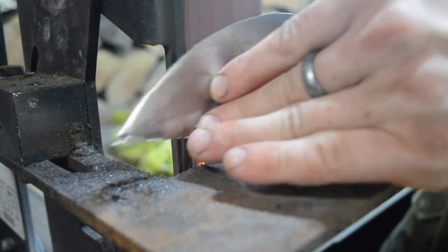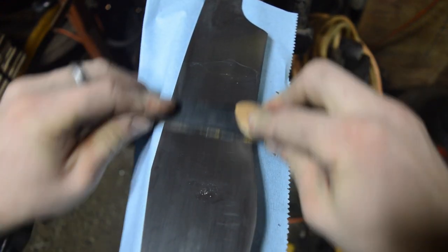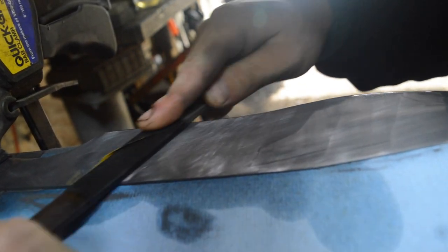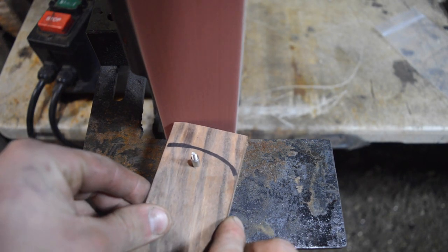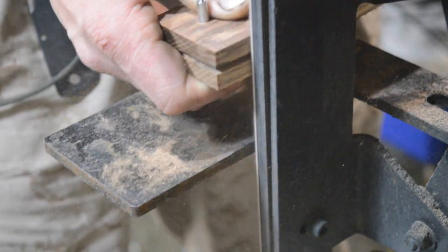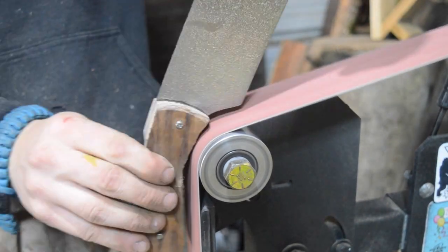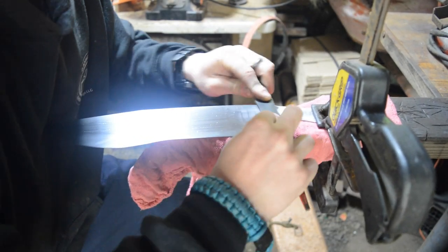I'm going to grind away and shape this knife to its actual final shape with the 2x72. Then take it over for some hand sanding from 36 grit all the way up to 600 grit. I'm going to change the way I hand sand just a little bit by going 45 degrees — it does the same thing as going 90 degrees but it's just more efficient and there's less hassle. I'm going to use some African wood that I bought from Texas for the knife handle scales, getting the general shape done on the grinder and then doing some extensive hand sanding at 600 grit. First I'll get the blade to its final polish and get it ready for handling.